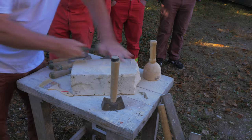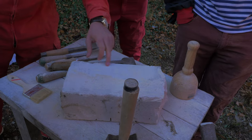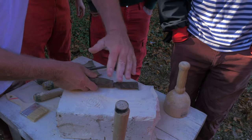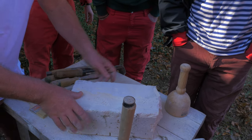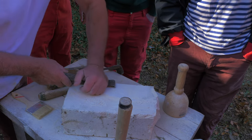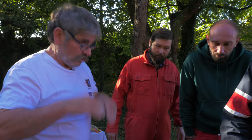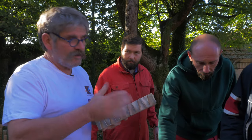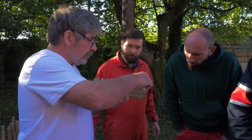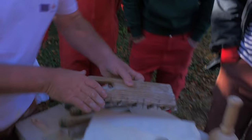The 'rip' tool allows you to get a flat surface, but the stone is not homogeneous and the man applying it doesn't press evenly — so the stone is harder or softer in places. This creates what I call the 'corrugated sheet syndrome': where the stone is soft, the tool sinks in more; where it's hard, the tool lifts up. The more often you pass, the more it goes up and down. That's why from the 19th century onward, they invented the 'chemin de fer' — a tool with blades positioned so there is always a part pressing on the stone, giving a truly flat surface.